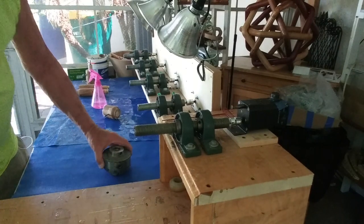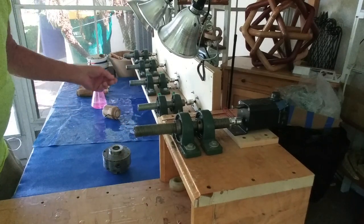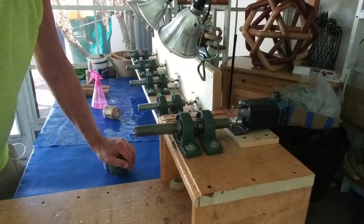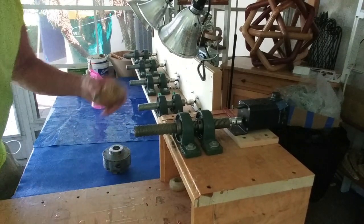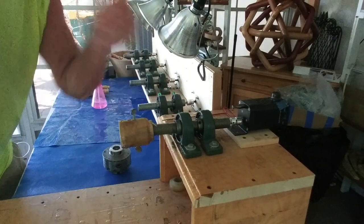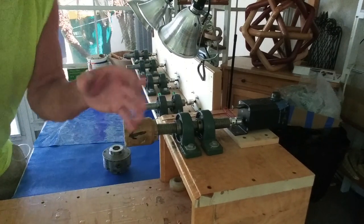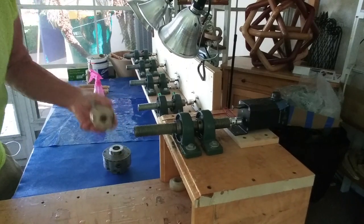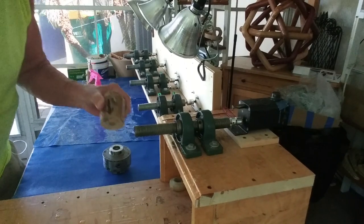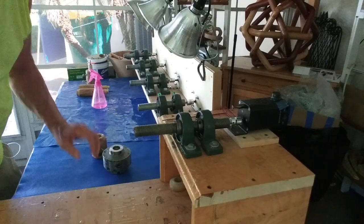And also if you had one of those spheres on it with the pin coming out, you could use a pin jaw chuck and put that on, and do the same thing. It's just quicker and easier to use these that have the hole in them, slip them on quick. Because if you've got epoxy fairly thick all over your piece, you don't want to be messing around holding it in one spot for too long, because epoxy wants to run. So that's it.